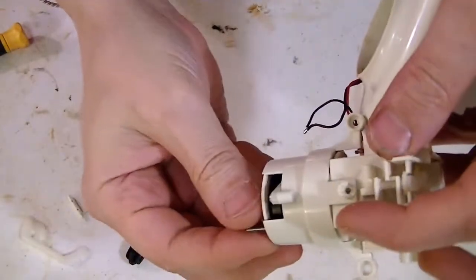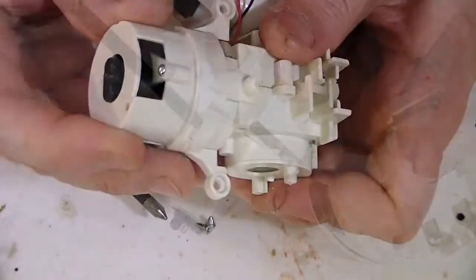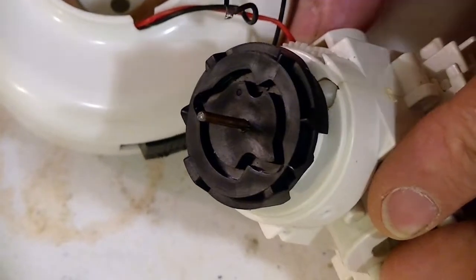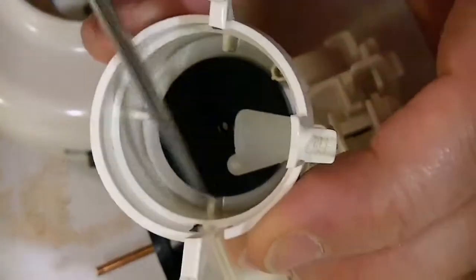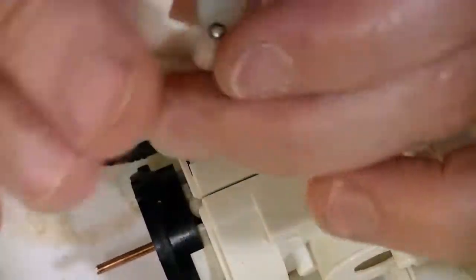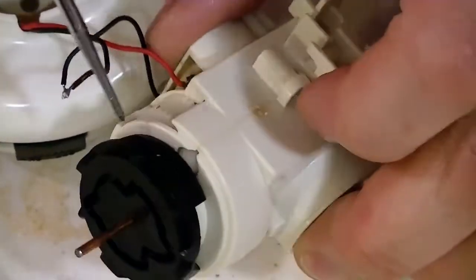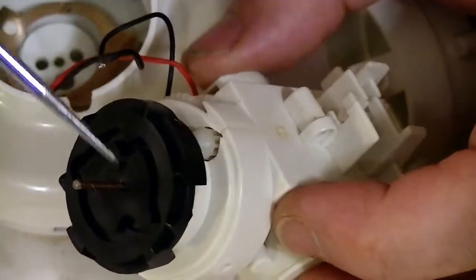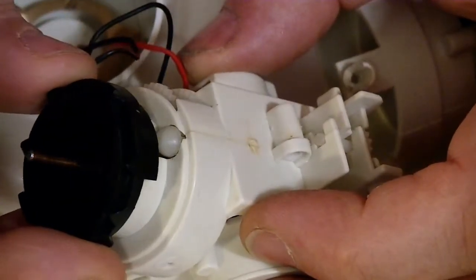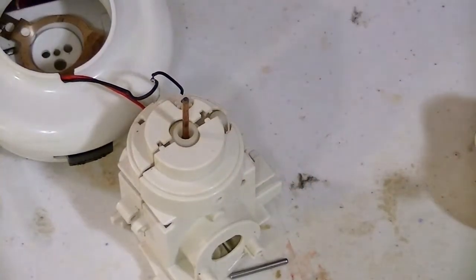There's this little pin right here. There are two screws, one on either side, and they're different from the other ones. Here we have this slot in this piece of plastic that spins around. That little slot has this little pin in it. As that moves around, it causes the pin to be pushed back and forth, which in turn makes the head swivel back and forth. On the side here you can see other indentations — this is essentially the programming. This is classic Tomy, just like the Dingbot and the Spotbot and all of those. I think I need to go ahead and desolder to get it out of the way.